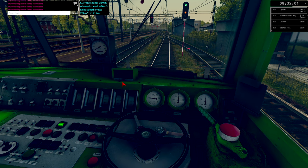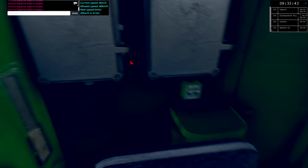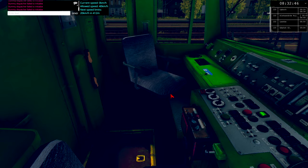So, as you probably remember, while we were starting the locomotive, I turned on the left bright light on the cabin B, or underneath the cabin B, which basically means that I already did half of the job. In this cabin, you need to set the white right light, which is this dial. When you turn it on, the light that is underneath the cabin is lighting up white, and the white light on the left side of the other cabin, which is exactly opposite, is also white at the moment. Oh, let me just close the doors.